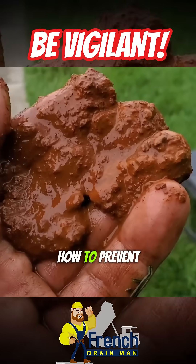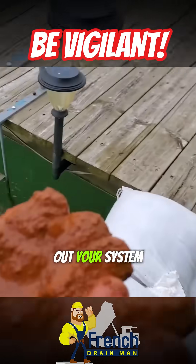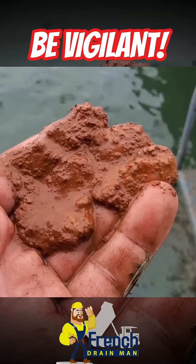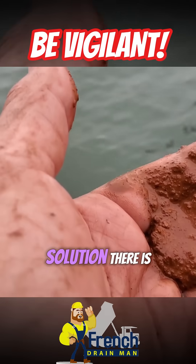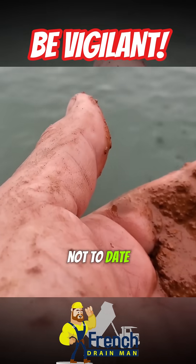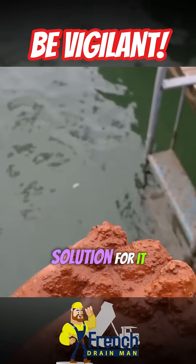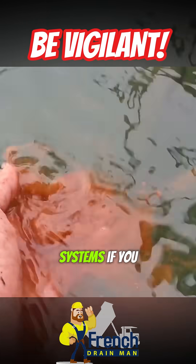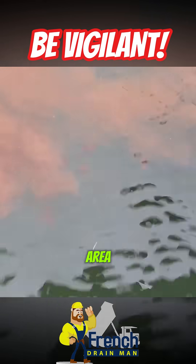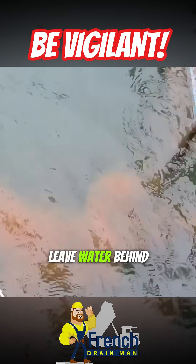We'll take the mystery out of it. How to prevent it? You dry out your system so you don't leave water behind — that's how you prevent it. What is the solution? There is none, not to date. At the time this video was made, there is no solution for it. So you have to be smart about how you build your drain systems. If you know iron ochre is in the area, make sure you're vigilant and you don't leave water behind.